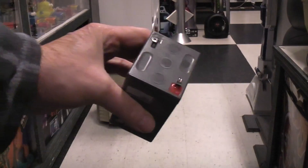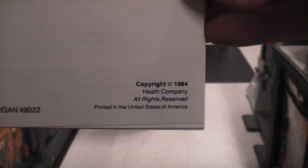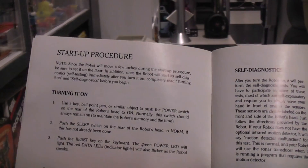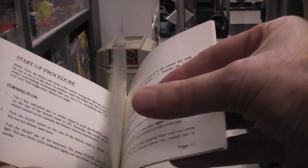Initially I took out the two six-volt batteries that were still in there — thankfully they hadn't leaked, but of course they were dead. Right now I've wedged in a 12-volt battery from my UPS, wired in series like the two six-volts would be. It's sitting inside off to one side, so the robot's a little off balance. I assembled it as a kit, and here you can see the date. It went through self-diagnosis when I initially powered it up.